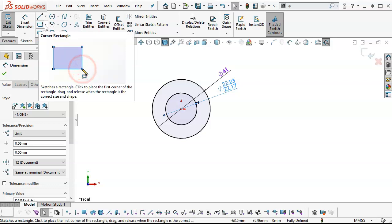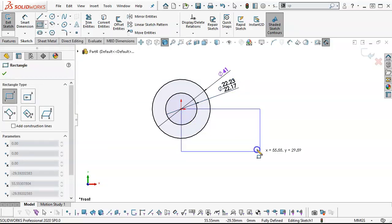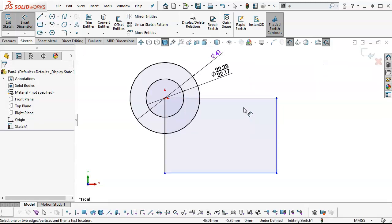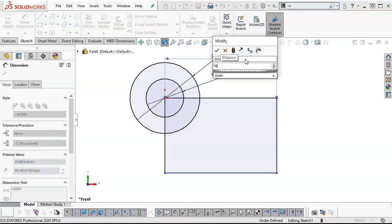And then for the step, that looks like it comes off of center, so I'm going to bring this off. One of the nice things about contours and regions is they don't have to be super picky. I can add in geometry and not have to worry too much about cleaning it out. So from the origin back, we have 76, but then we also have a radius of 17. I'm going to go ahead and include that, so 76 plus 17.